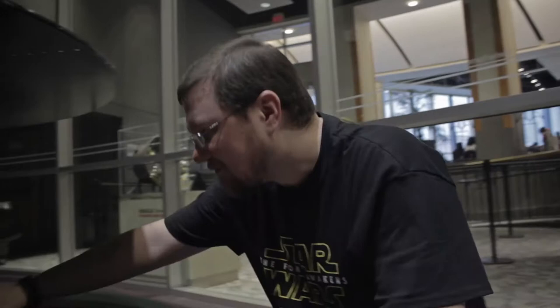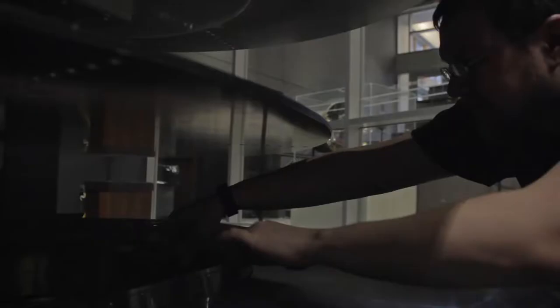When we load a film, first we pull this ring — which is really awkward because this thing is huge — and then we roll up our film. Just like the film has tail, this is head. So we can touch this without affecting the actual quality of the print. This is actually an old trailer. And this is that foil tape I was telling you about — this foil tape will stop the projector at the start frame, keeping everything in sync.